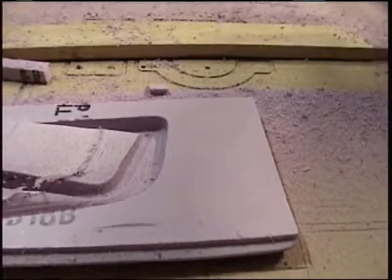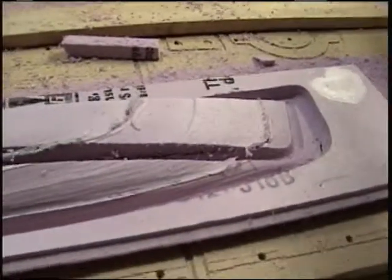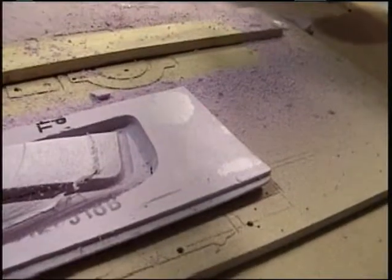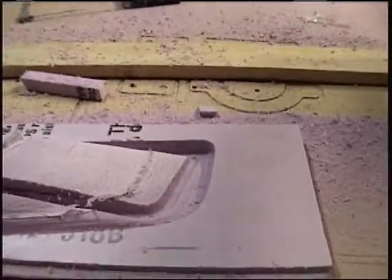That's another experiment, trying to find the good balance of speed and accuracy that you want. I think I could speed up the toolpath. I was running at 140 inches per minute, and I think I could easily run double that, since it's not removing hardly any material at all. It's just a matter of a few thousandths, so I shouldn't have a problem with that.